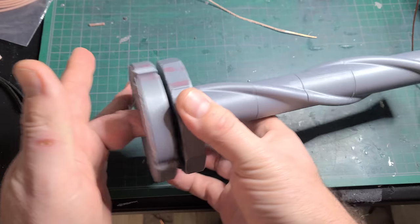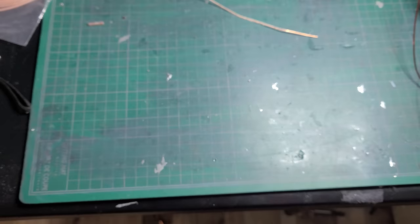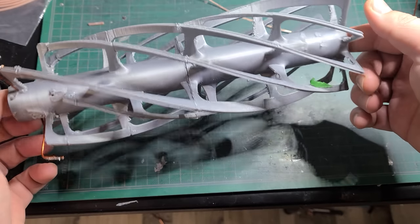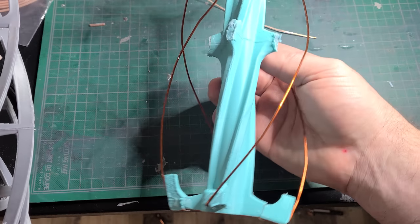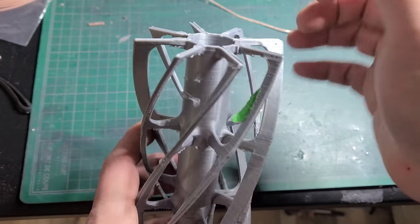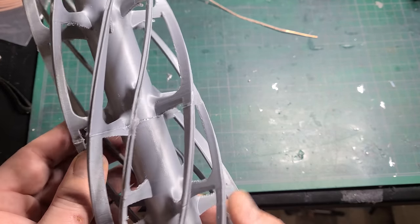Lesson learned — very nice tool, very satisfying, but just doesn't work. So then we went the opposite route and tried to make a complex helical that incorporated two different frequencies. Instead of having four conductors it would have eight, tuned in pairs to different frequencies to get the best of both worlds, because the frequencies we're interested in are 401 MHz as well as 437 MHz or thereabouts, with about five to ten megahertz bandwidth on both sides. That didn't work either.